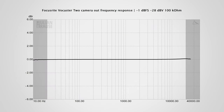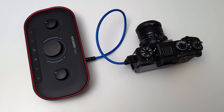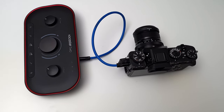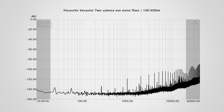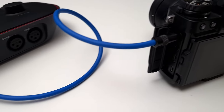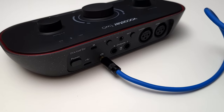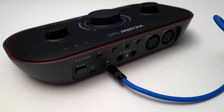Let's have a quick look at the camera output. Its frequency response is super flat as well, but I had a bit of interference showing up in the noise measurement — various tones rising through the noise floor. I did a test with the output connected to a camera and honestly I could not hear this interference, so it doesn't really seem to be an audible problem. Not sure if other Vocasters show the same behavior or it's just mine. Because of the low output volume and the spurious tones, the dynamic range only came in at a measly 66 dB. Running this signal into a camera might still be totally fine though, as the 3.5mm input performance on many cameras isn't the best to begin with, and there's a good chance the camera output still outperforms the camera's input.